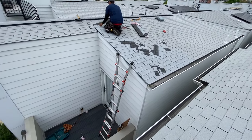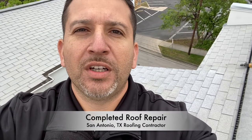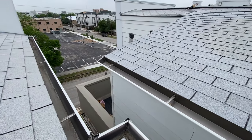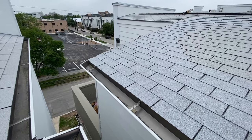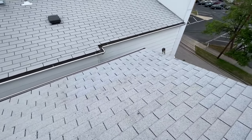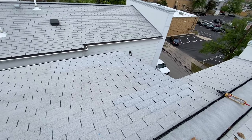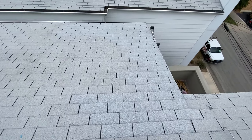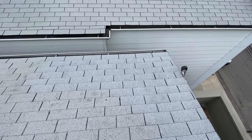The purpose of this video was really to show you that sometimes roof leaks are not where they appear. On this one, the actual point of entry was on the first level but it was coming in from the third story. What we had to do was remove the shingles, remove the decking, replace it, put ice and water shield, improvise due to the construction of the roof, put everything back together, and waterproof and seal the perimeter. Hope you learned something today. If you're in San Antonio and need a roof repair or replacement, give us a shout.